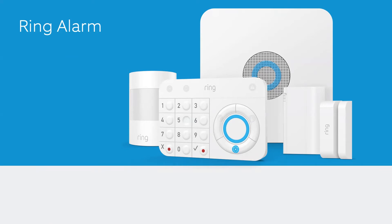The base station is the hub of the system. It includes the siren as well as LED alerts and spoken word — so when someone opens a door, it can say 'front door is open,' and when armed, it can say 'Ring armed' and 'disarmed.' The range extender operates over Z-Wave Plus, which gives about 215 feet of usable distance — typically 125 to 150 feet from the base station or repeater in a home.